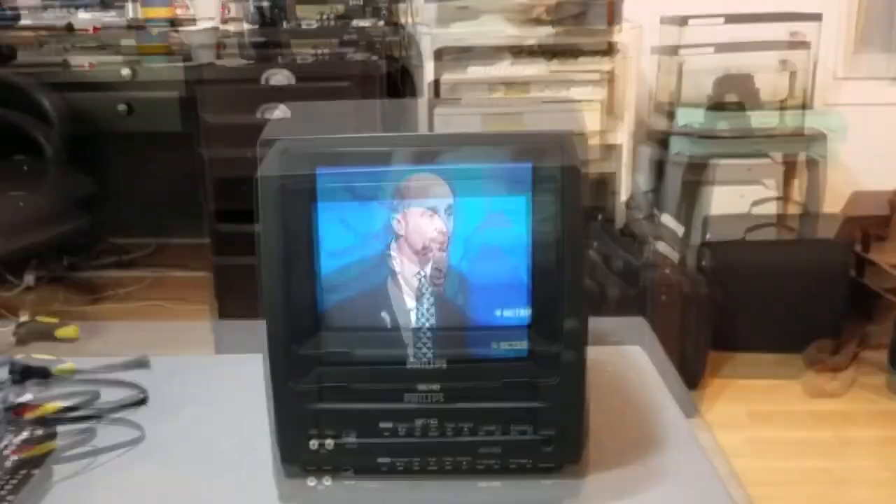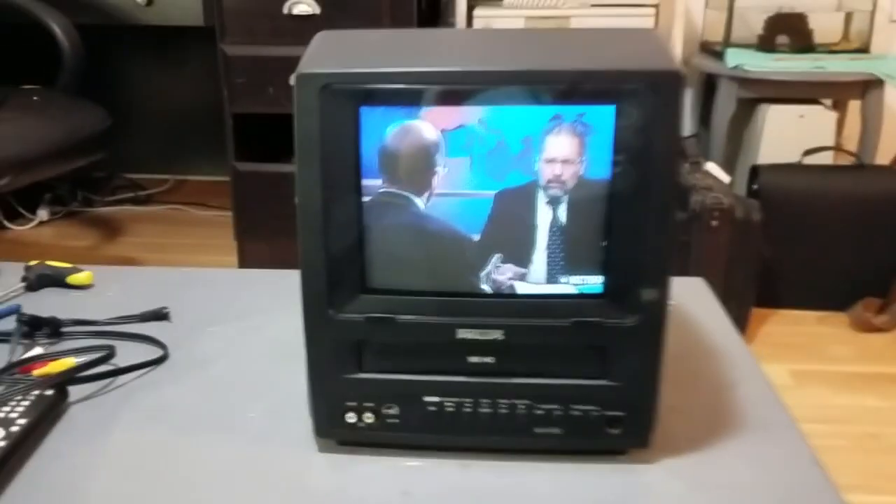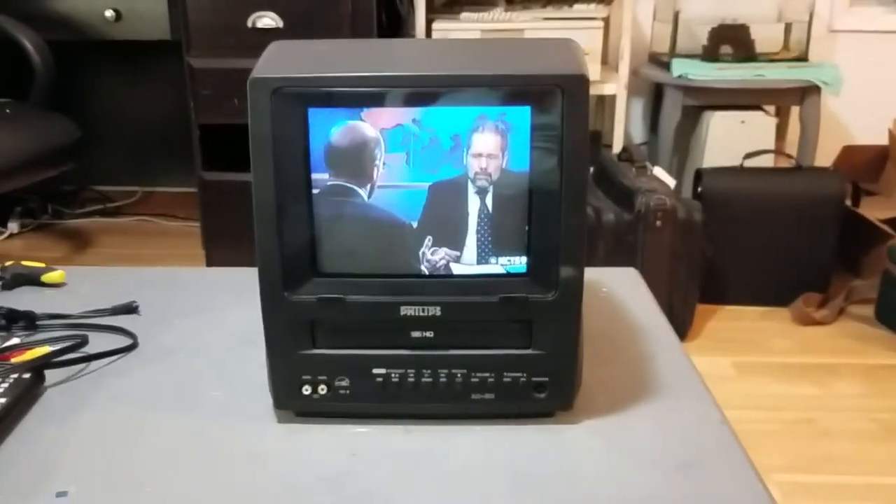Is it in the resting position? Is it in the ejected position? Is it doing a reverse search? So in order to get to that switch, I just had to remove the mechanism from the PCB. This is a modern VCR — it's a modern deck-on-board design. And I just had to remove the deck, which was easy to do. It was just a few screws and the deck just unplugs from the board. There are no wires — just unscrewing the screws and pulling the deck up from the board.